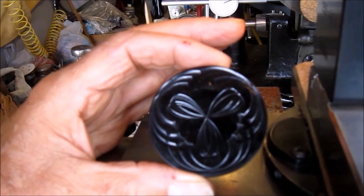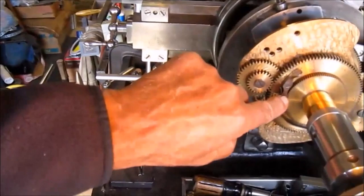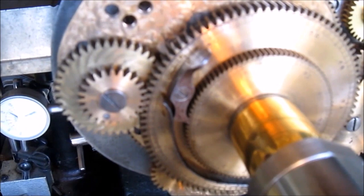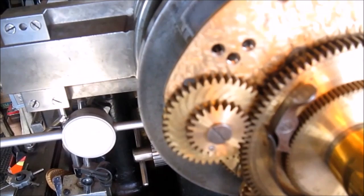And the 3 loops is just a change in your gearing. Right, in the gears. And with this chuck, you can also index. If I wanted to go a couple of degrees, I think there are 96 divisions on this wheel. If I wanted to go one click, I'd divide 360 by 96, and that would be how many degrees one click is, which is probably 3.75, somewhere thereabouts. So every tooth on here is like 3 degrees. Oh, it's the same catch. I see.